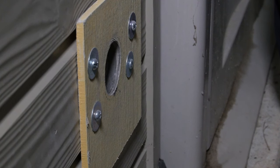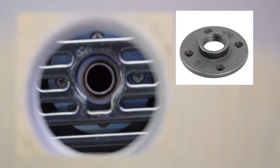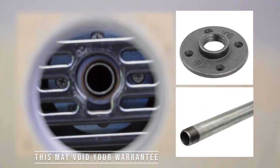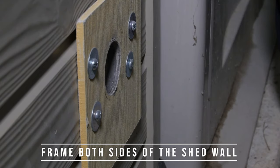On the opposite side of the shed where the generator is, I added a hole for the extended exhaust to be attached to the muffler. The extension required a base plate screwed directly into the muffler and a threaded pipe that fits to the desired length. The hole is framed out in hardy plank, which is fireproof.